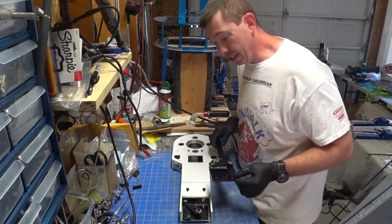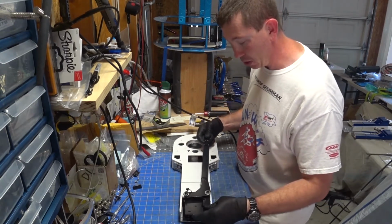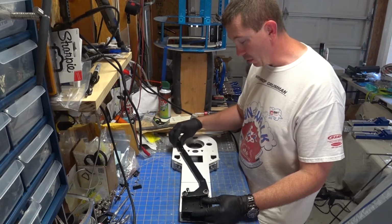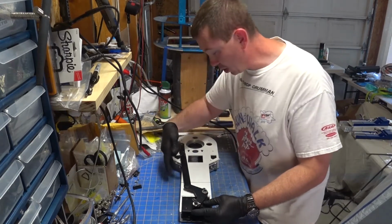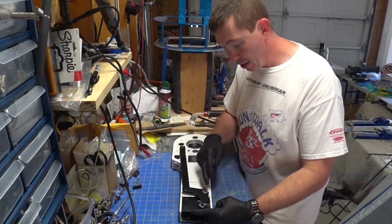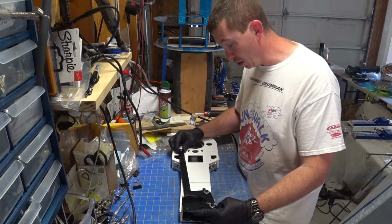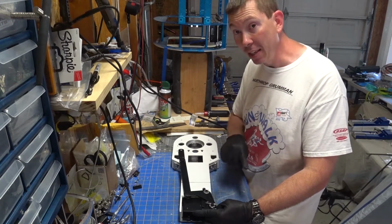This is the opposite leg's channel mechanism, and as you can see, it has a nice pivot mechanism. Now, if you were to stick this in here, and we're just going to rest it on top because that's all you really need to see, our pivot hole is over here where that bolt's going to go through, and it's going to rotate right through here. If you were to do that, you're going to see, boom, in order for it to get in the very first position, it is hitting on this corner. And if you were to try to go down farther, it binds through this entire side, and then you get this pivot point which is now hitting inside the aluminum on this side. So you would need to actually cut through this side in order to make this piece work. And it's going to be binding the whole way. And in order to get it all the way down, you now see this part has to stick out. It's a great indicator that you have these reversed.